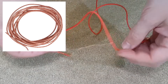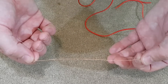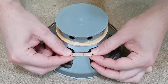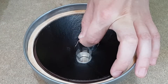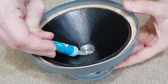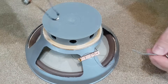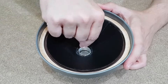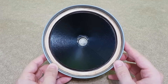For the speaker driver leads, I need some flexible braided copper wires. I don't have that exact type, but I will use this flexible wire with very thin threads. For the terminals, I will use a small piece of copper cladboard. Now I need to insert the flexible wires through the speaker cone and solder them to the coil and to the speaker terminals. I will cover the soldering joints with superglue so they will be fixed to the cone. Now I can finally remove the plastic strips and test it — the voice coil alignment with the magnet is very good.